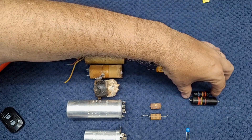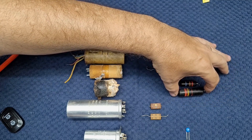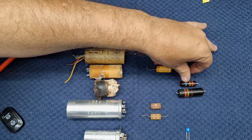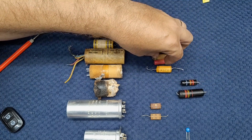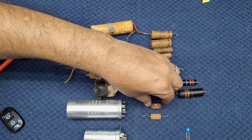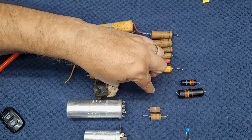These two guys here fall into the same class. These are known in the trade as bumblebee capacitors. The color will denote the specification and size of each of these capacitors. These leak, they go bad, they short — they are no better than the paper wax ones. Again, these are immediate replace. So the silver mica capacitors that look like dominoes stay unless you prove otherwise.